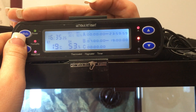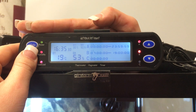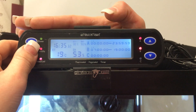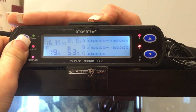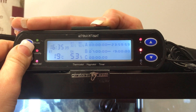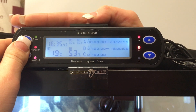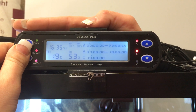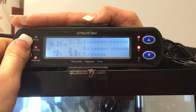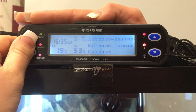Now we've gone to part C. As mentioned, part C is the one we're going to use for our nighttime heat source. We'll hold set. We want timer one to start at zero and timer two to start at 7am. Timer three we've got set for 7pm, and then the rest of them — four through to eight — just leave at 2359 and they'll cancel themselves out.